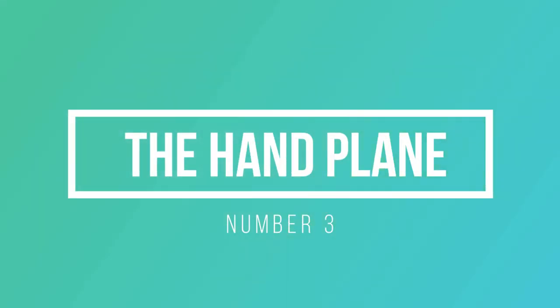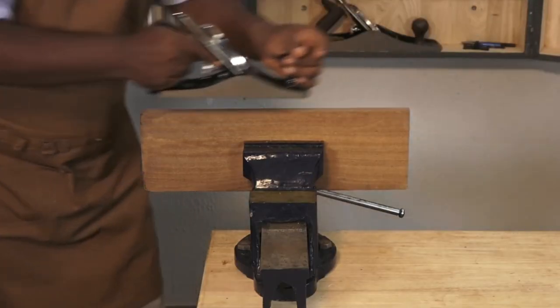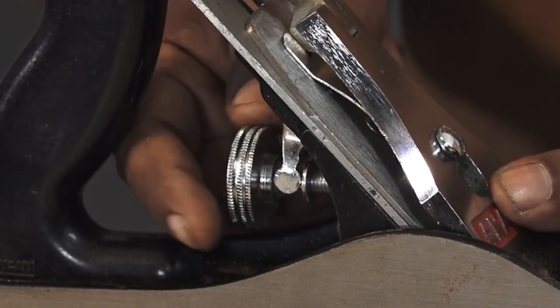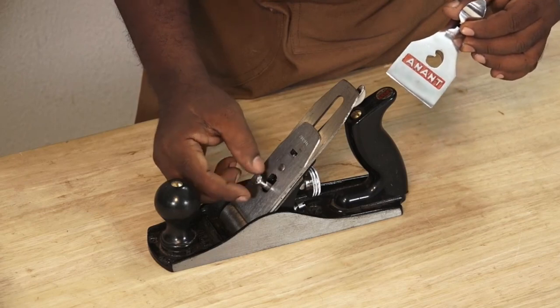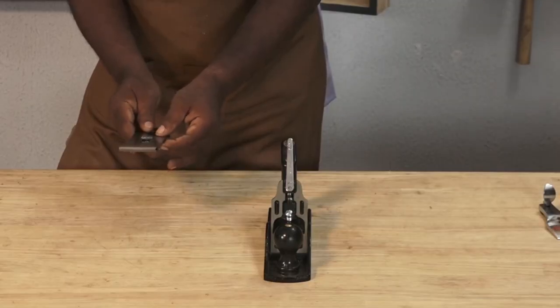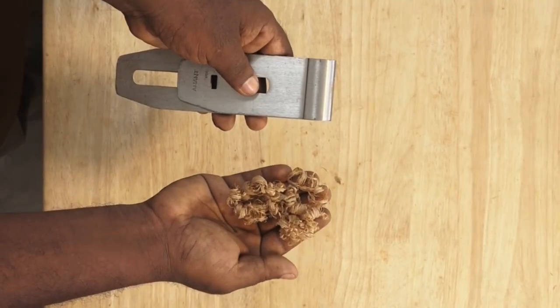The Hand Plane. A hand plane is a key to creativity in your woodwork. You can flatten a piece of wood, add a curve to it, or square your work. Sharpen or chamfer your pieces using a block plane. Once you have a dovetail joint, you can smooth it with your hand plane rather than spending endless time sanding. Your plane can also ease a piece's edges, removing their sharpness.